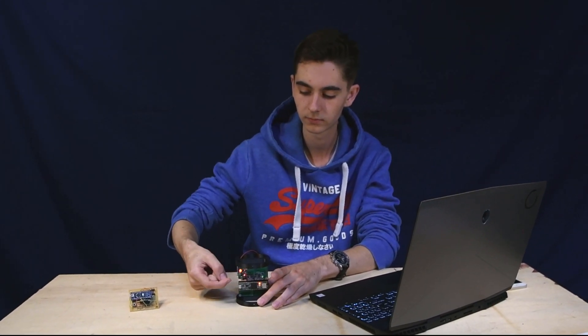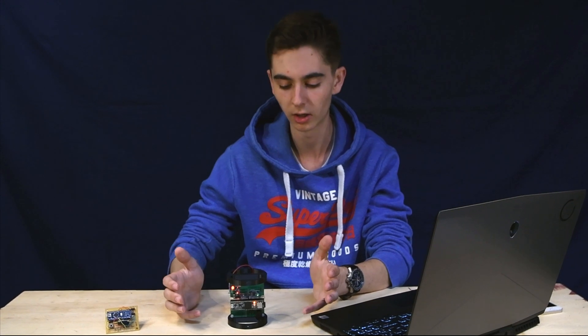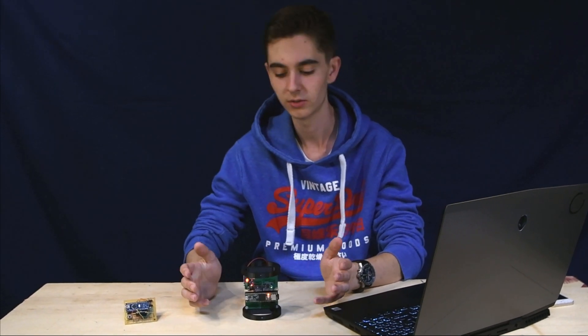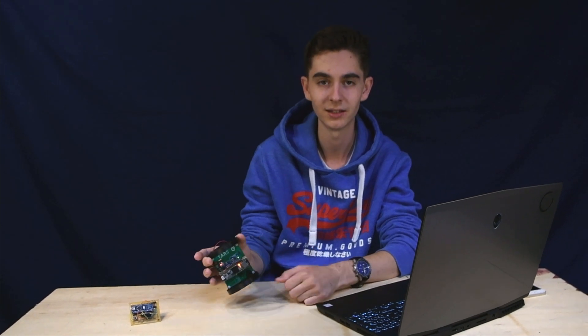When we arm the flight computer, you can see it'll enter its pad idle mode. The LED will turn on once the IMU has been initialized, the pressure sensor has been initialized, and the SD card is ready to write to. The buzzer will be on while we're in pad idle — so when Luke is arming the rocket, he can listen for that buzzer, and as long as he hears it, it means we're ready to fly and he can go start the ignition sequence. Once the rocket detects liftoff, the buzzer stops, and it begins thrust vectoring and logging all the data — basically doing all the flight computer things it needs to do.